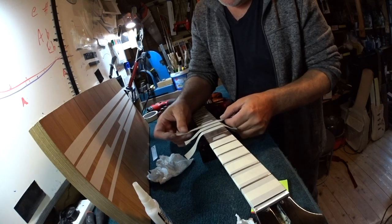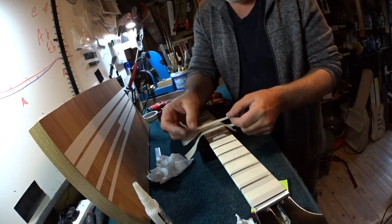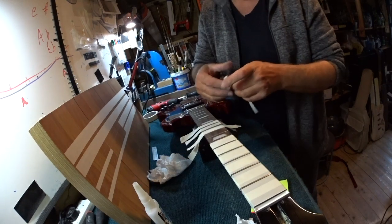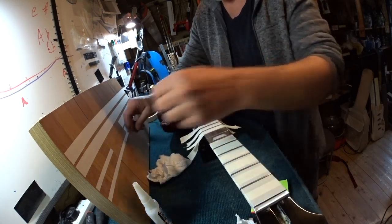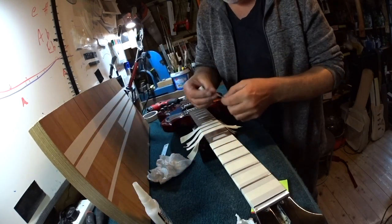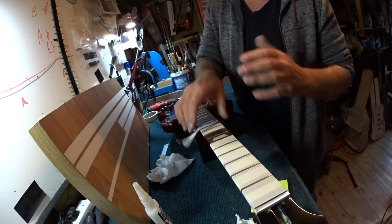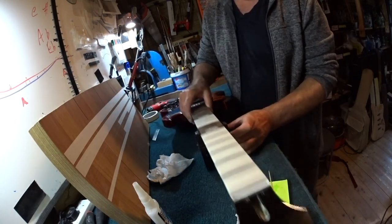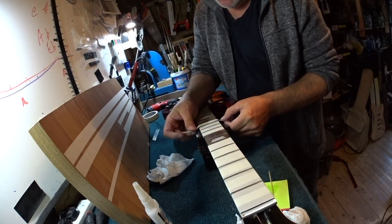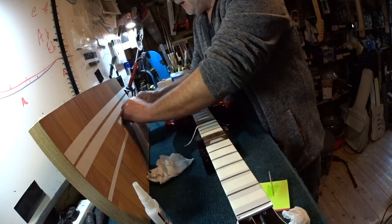Yeah, so the first half is your nut slots. Hugely important, and like I said a bit earlier on, the biggest single transformation you can make to how the guitar plays, both in terms of the feel of the action down here, but also in terms of the ability to stay in tune because of the quality of the nut slots, or the clean running and lack of friction in the nut slots. But also when you get the first fret action right, you also get rid of those sharp notes played down by the nut, which this guitar, as I mentioned, was definitely suffering from. So huge, pound for pound, the biggest impact you can have on your guitar if you can only do one thing.